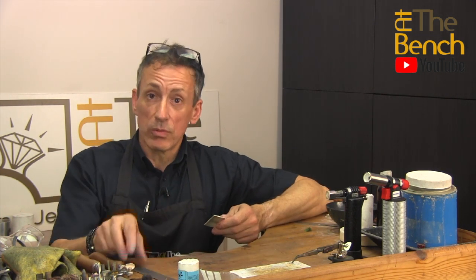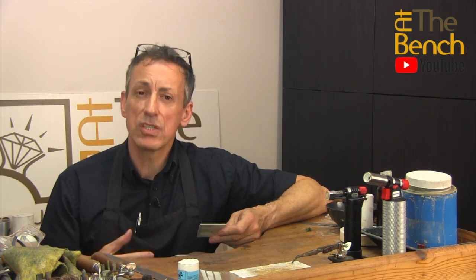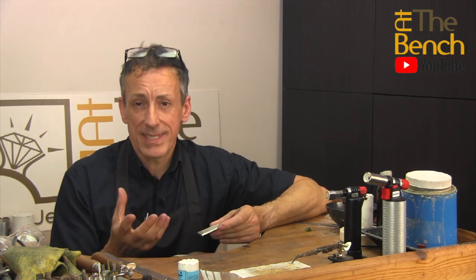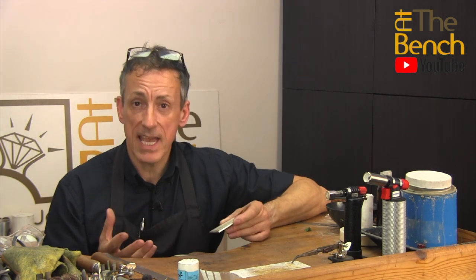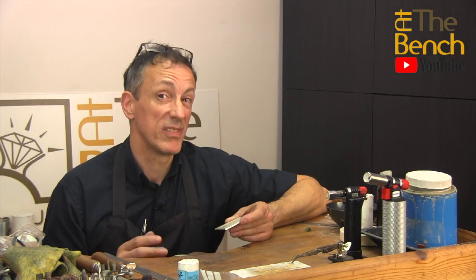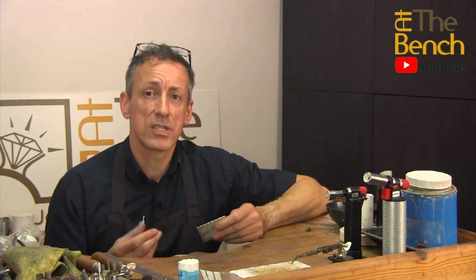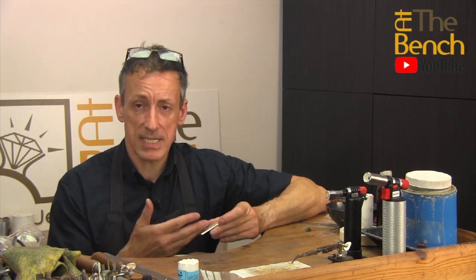What you could do though is heat it up, warm it up and let it cool gradually again, just to make sure that it is now completely annealed and the crystalline structure has all been realigned. Yes, you can do that — I'm not even going to do that. I'm just going to go straight into the front studio where we've got a nice brand new Durston rolling mill and we're going to use that now to take this down.